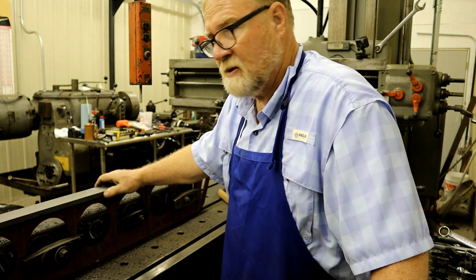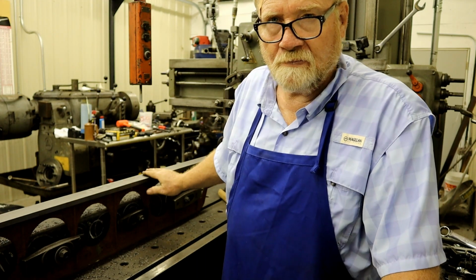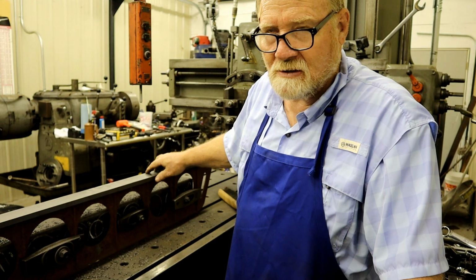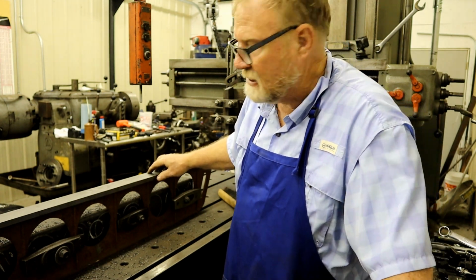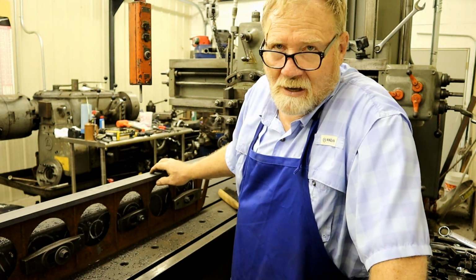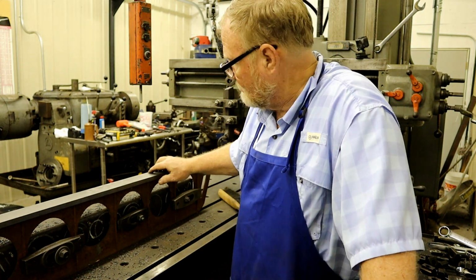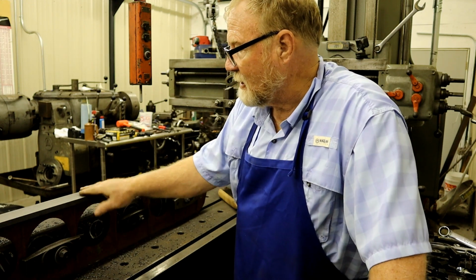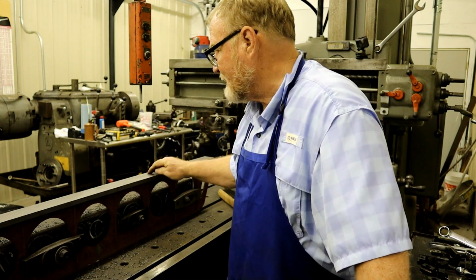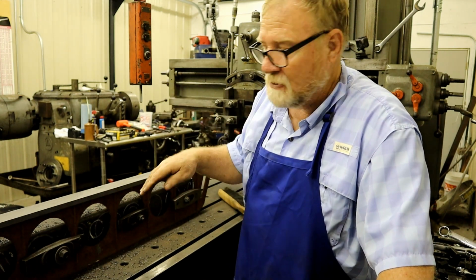So I'm going to take it down until that spot disappears with my roughing tool. And the reason I'm doing that is because that spot around the edges has got white cast iron, and it was chilled when it hit that. And every time my razor sharp blade, or my newly sharpened finish blade, goes past that sucker, it's going to affect it. It may jump up a little bit or whatever. I want to try to start off with the same density of cast iron everywhere. That's a hard spot. This is a really heavy clapper box, but it'll still jump up when it hits that.